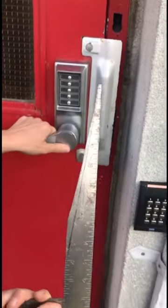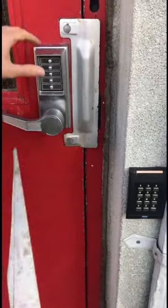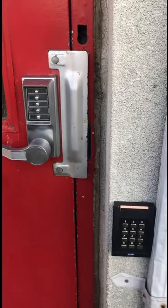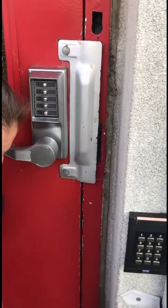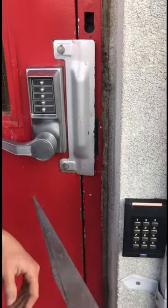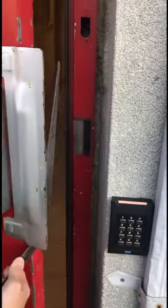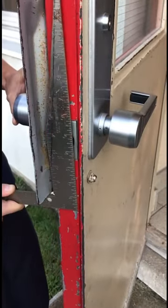So I'm going to use my modified framing square to get through here. A bit of passive entry — we hear one click to get that dead latch into the keeper. I'm just going to put my body weight on it. Hopefully you'll hear a second click — there's my second click. So now I know I can attack this latch, and all that modified framing square is going to do is hold that latch shut.